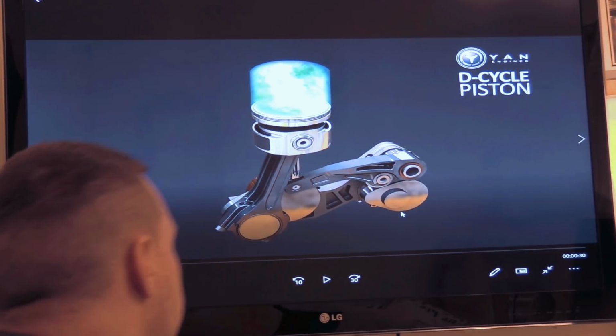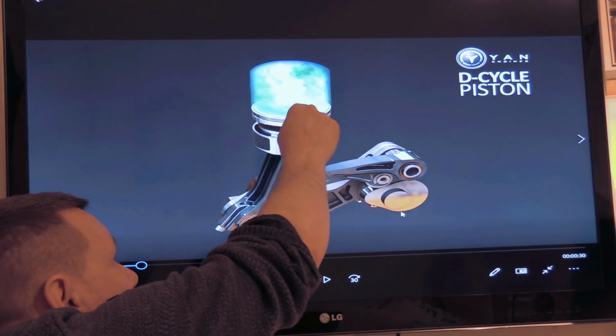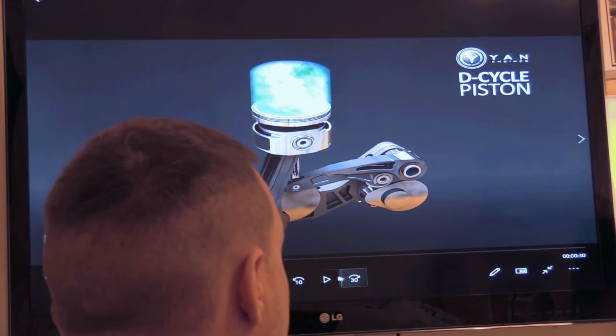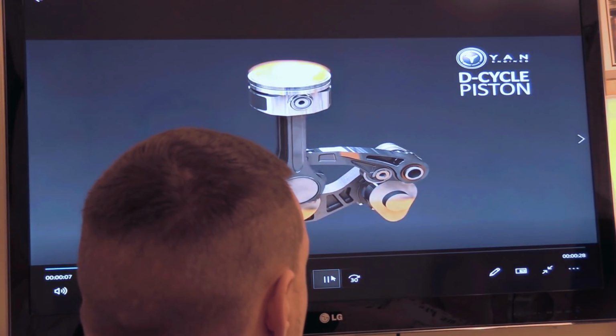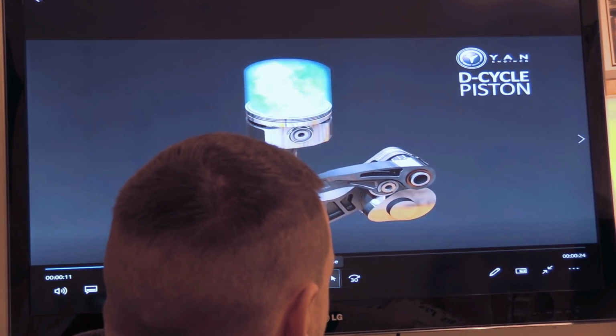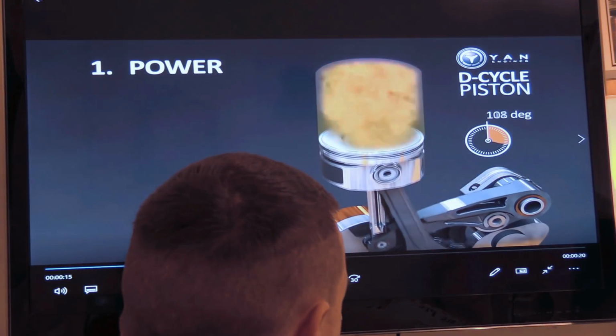So in other words, this is the wrist pin for these rods, but this rod here must have a wrist pin itself as well, just like a mini version. So you can see there that this rod is articulating, you can see it bend there. As it pushes up, you'll see it in slow motion a lot better.